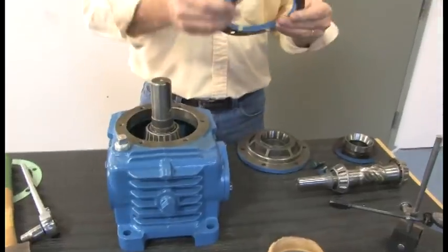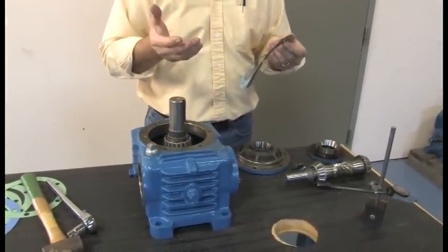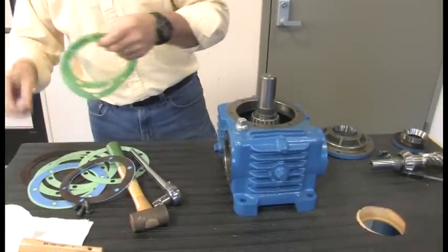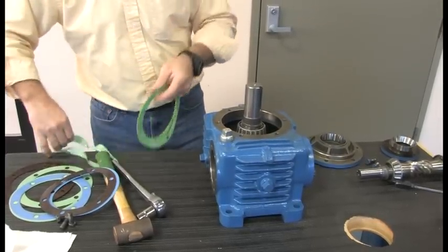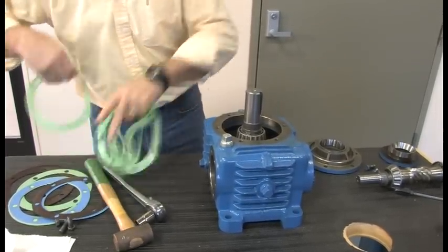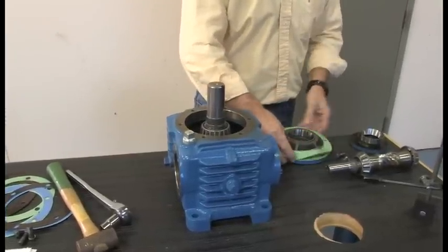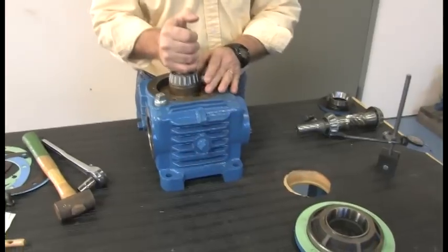I have 15 thousandths in it, so I need to take three out — that gives me 12. Four threes equal 12. And this is all set for the bearing settings on the output shaft, also called the slow-speed shaft.